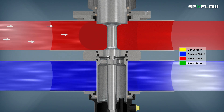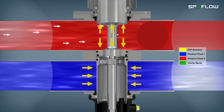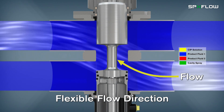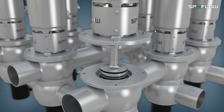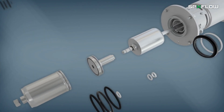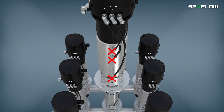D4 valves are highly reliable with a fully balanced design and a large leakage cavity that helps prevent hydraulic blocking, withstand pressure spikes, and enables a flexible flow direction without slamming. The valves are lightweight compared to other models, which helps with handling when conducting routine service. Air and access to the lower section of the valve are also not required for service or removal.